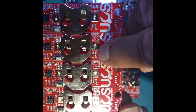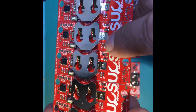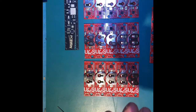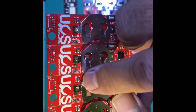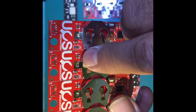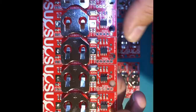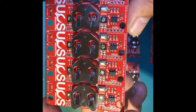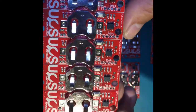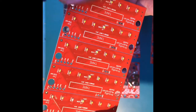This guy — one tombstone over there; I don't know if you'll be able to see it, these 0603s are pretty small. And then a not-so-star performer: one there, one there, one there, one there — I don't know what happened there, I suspect my stencil printing was not what it was supposed to be. Not too hard to fix at least — the resistors are easy to fix. These LEDs are very hard to fix, that's why I load them first and get them out of the way. Let's try better next time.